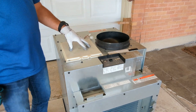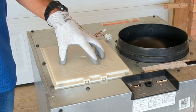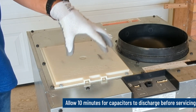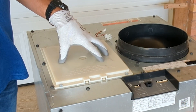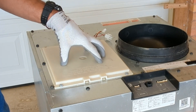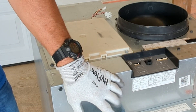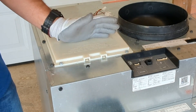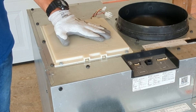With the make-up air channel removed, we're going to start removing the cover for our inverter board, which is located under here. It's important to remember this inverter board has high voltage DC to it, and it takes a while for the capacitors in this unit to discharge. Allow the unit 10 minutes to sit after turning power off and removing power before you start to unplug or work on any electrical components on this unit. Even on the main board, away from the inverter board, unplugging connectors could discharge a capacitor and cause a failure of your main board or fan components. Make sure you allow this to discharge for your safety and so you don't damage the product further.